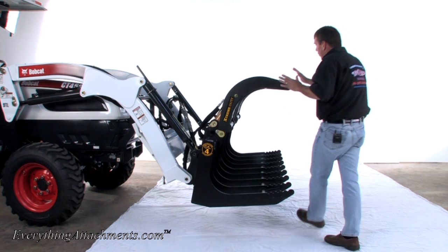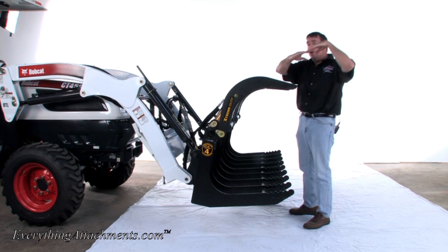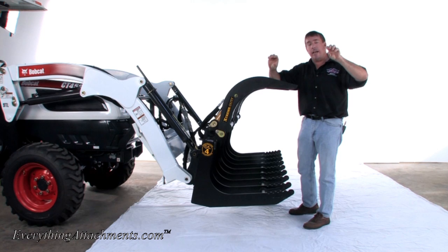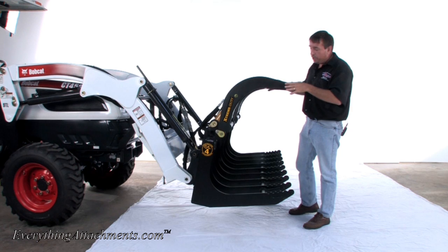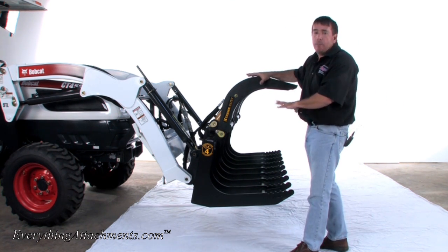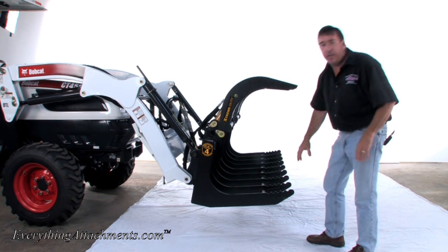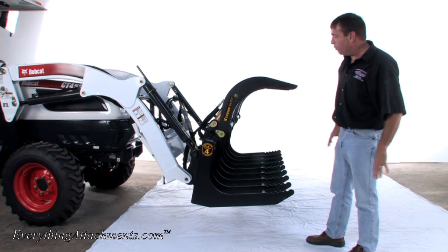These grapples are independent, and that's what you want. If your load is irregularly shaped — from a large load to a small load — you're going to get the same amount of clamping force on both ends, but the grapples may not always work perfectly together. One may open a little before the other, but that's what you want it to do. When they work independently, you're able to get a lot more pinch on your load, and this grapple will clamp right to the very tips rather than way back, so you can pick things up better.